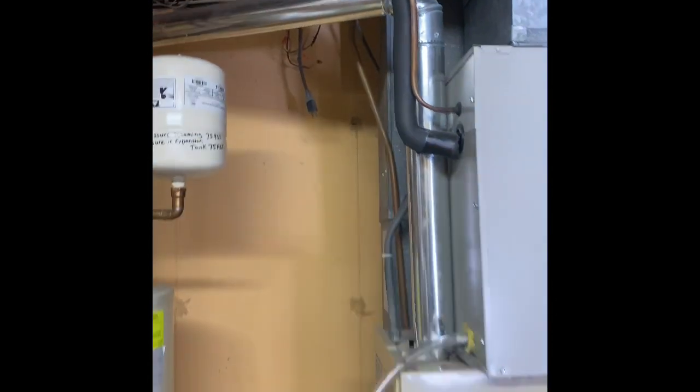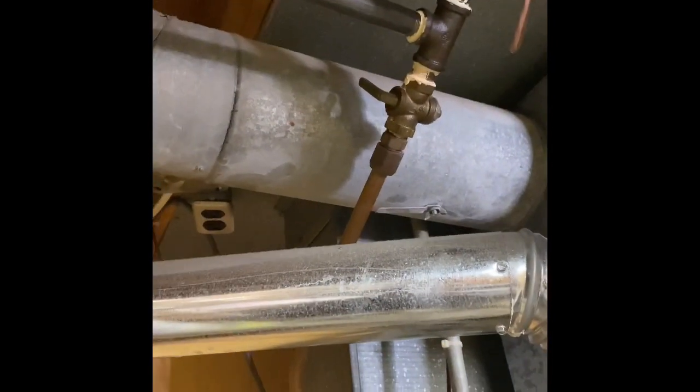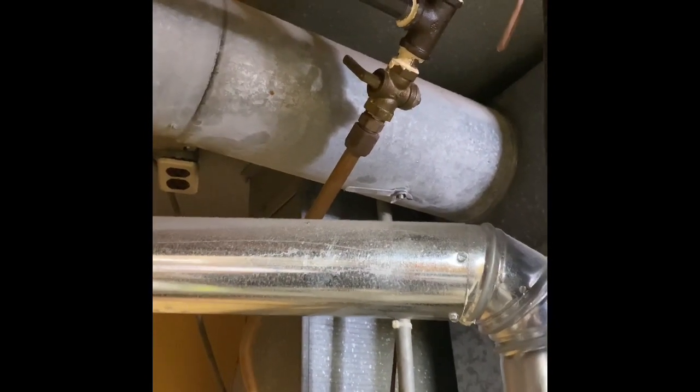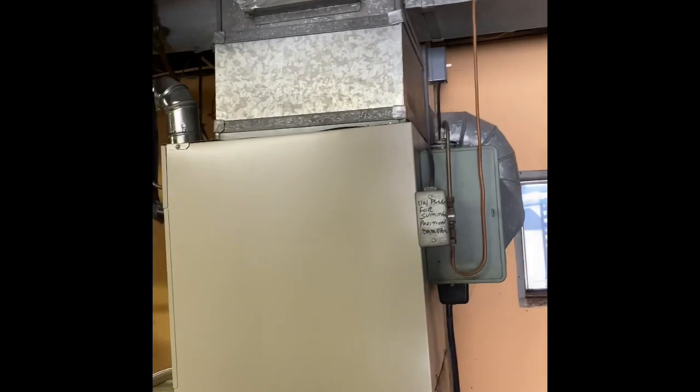Refrigerant lines will just flush and pressure test. Gas line, we may need to do something with that. There's a shutoff valve there, and then it runs back down to the furnace in copper with a bunch of flared fittings. I really don't like those flared fittings, so if we can rebuild that in track pipe, that would be great. Or if you guys want to press it on with our new pressing tools, we can practice with that as well. Humidifier will just get reinstalled.